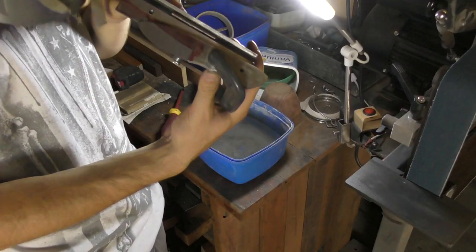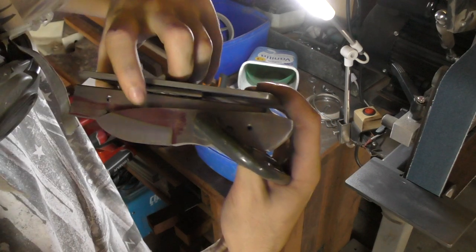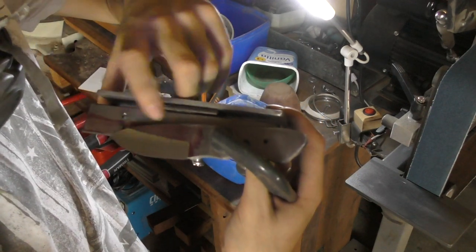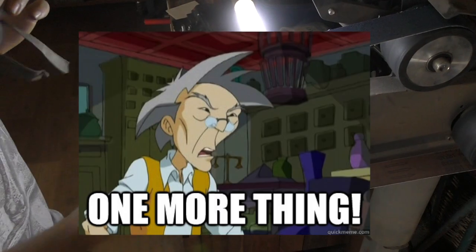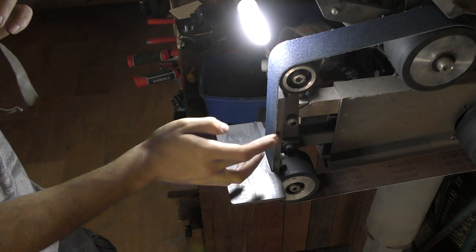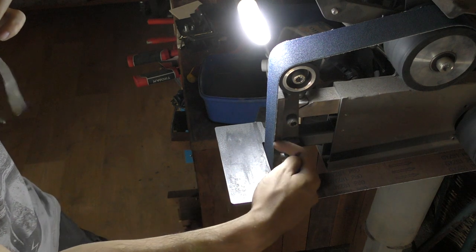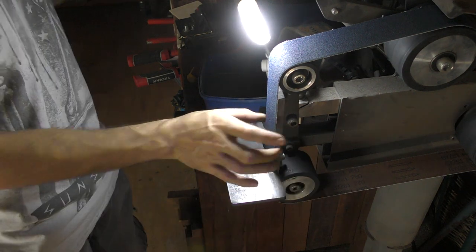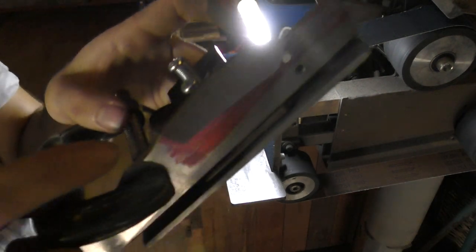You can see that it's pretty consistent right along there as we run out. Our line is just a little bit higher — still got a little bit more work to do on the end. One more thing right before I start: you'll notice that the belt is actually just hanging off the edge of the platen, so I can actually get my finger behind it. That's so I get a really nice radius right there in my plunge line.